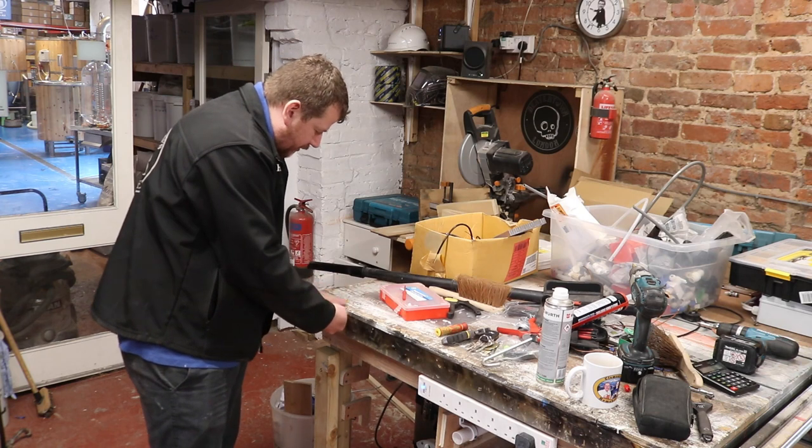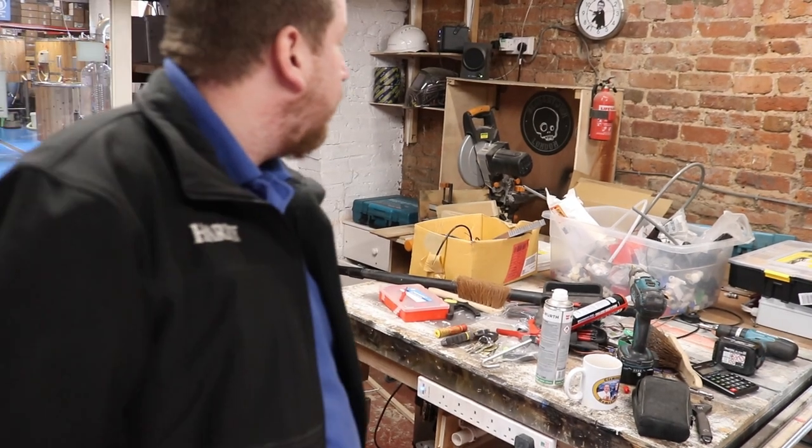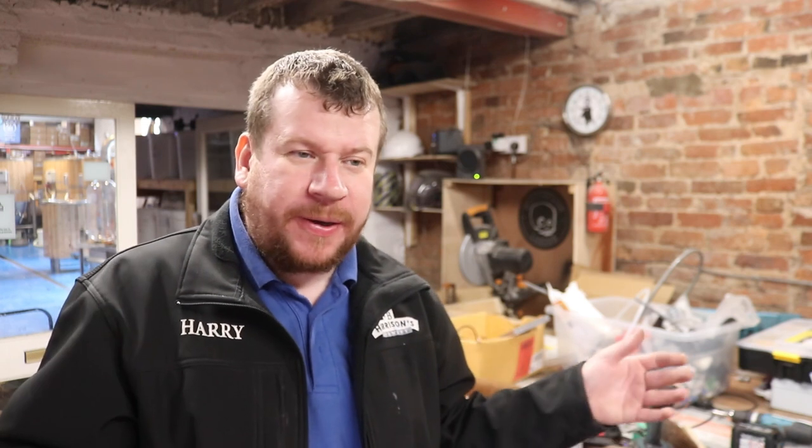Apart from a little tidy up, that's me done in the workshop. I could tidy the floor but I can't be bothered. While I'm here for a couple of hours I'm going to mix up some more resin — we've got some more in — and go around the brewery filling the cracks, dimples, and holes a little bit at a time. Eventually we'll put one last top coat on with some anti-slip and it'll be done. I'm going to extend this touch-up period for maybe a few months to let other patches emerge before top-coating.